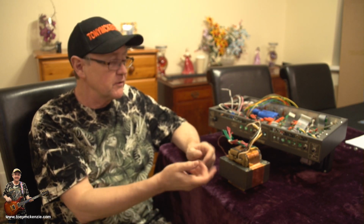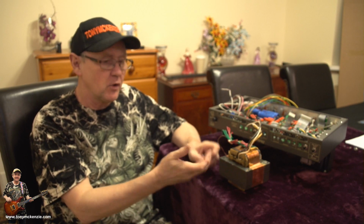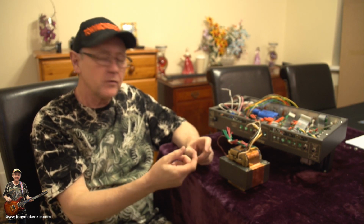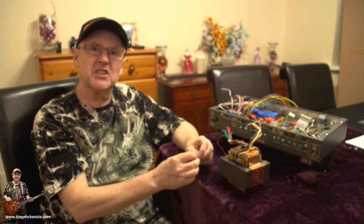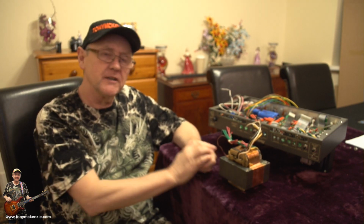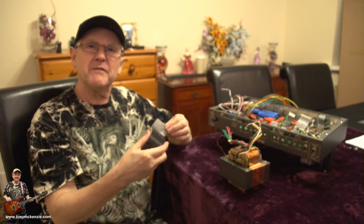There's lots of things you could do. One of the things is you could put the new nylon washer on, that's the old one if you get me, on the top. And you've got one for the bottom too, except for the one that has the ground. Remember the one that had the ground over there? Anyway, you could take one of those screws and put some heat shrink on it and shrink it on so that it doesn't touch. That's a good idea. Or you could take something like the old gaffer tape. Now I heat shrunk it, or heat sealed it, or you call it what you like, and stuck it on and shrunk it down and fitted the screws in, and it's back in the chassis actually.